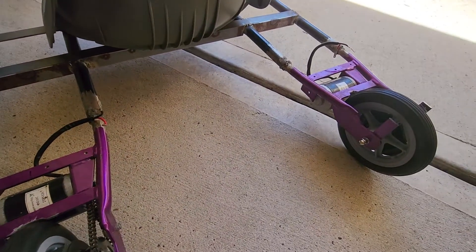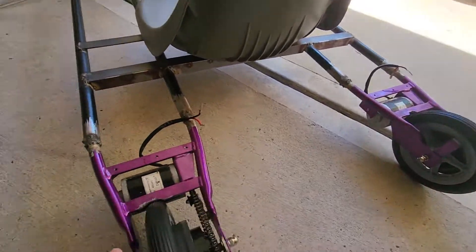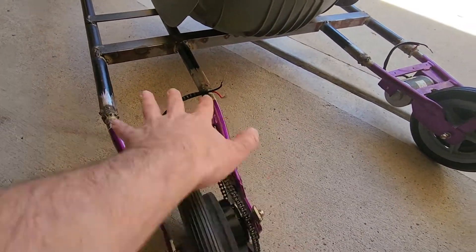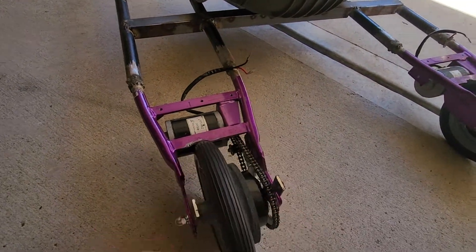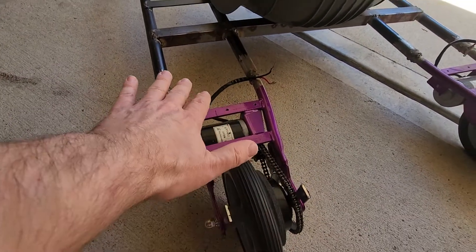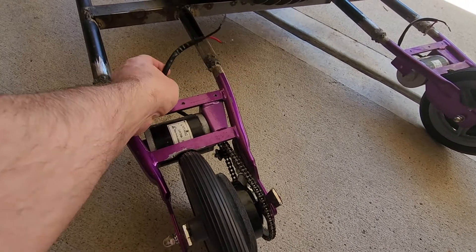You can see there's a cut here - this is the bar that sat over the wheel where the fender came into play. That's cut off because the bigger wheel didn't clear. That's one thing to keep in mind as the build progresses.